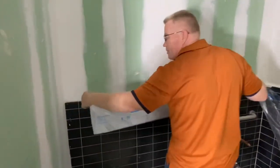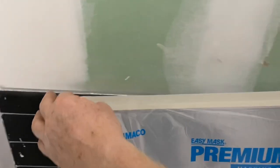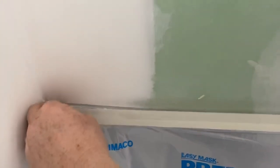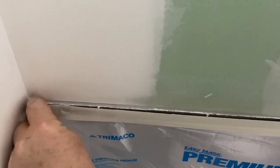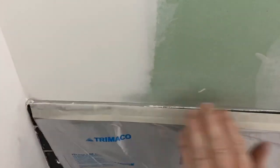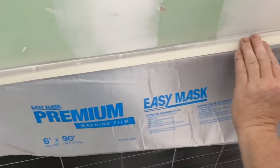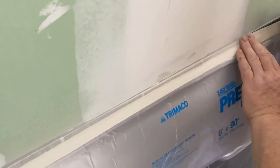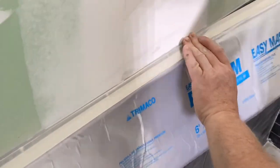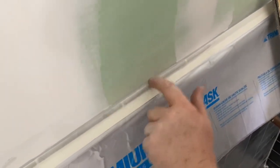Let's put it on. Wherever your tape lays is going to be the line of your paint. So let's say you want it to be the perfect line just right up against the edge of the tile — that's fine. Wherever you choose, if you want to cover the grout, that's fine too. Or if you just want to cover the tile, you have to be consistent because this is going to be the colored paint line. In other words, wherever the tape is not will be paint. So if my line is going like this, your paint is going to go like that too.